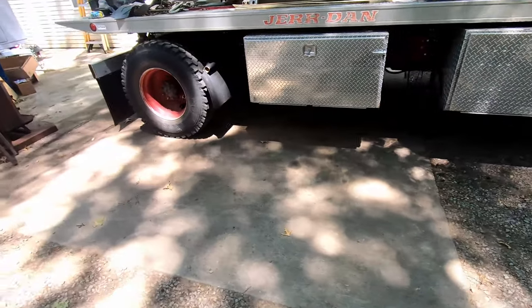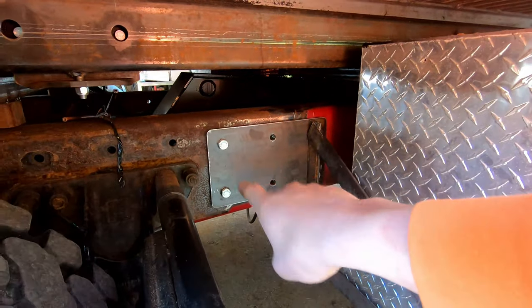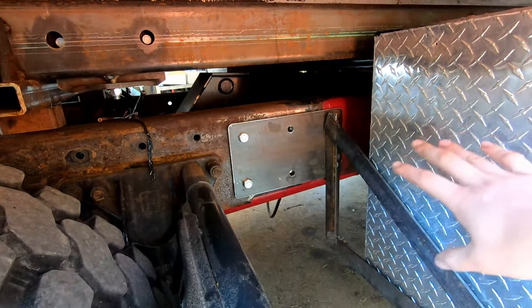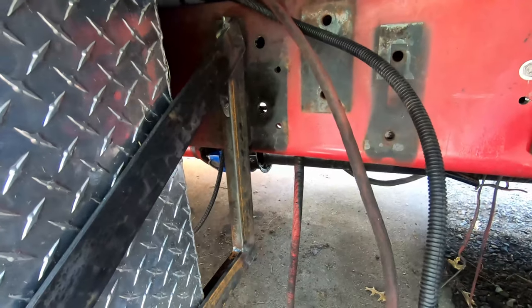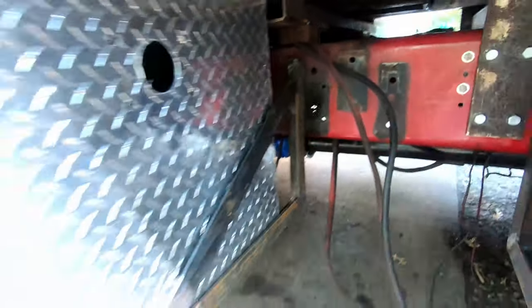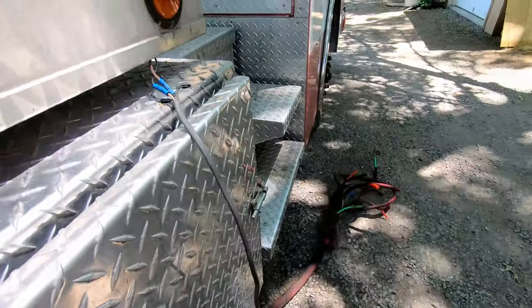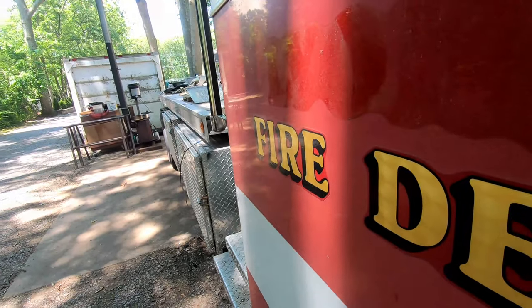Look at the toolboxes — that looks good! I made these simple toolbox brackets. It's two pieces of angle and flat bar with a couple holes drilled. I actually utilized some old holes from the frame support bracket — that's where the frame got welded together — and then I added that bracket in for extra support. The weld will never break but it's there just in case. There's a 3/8 spacer in there to keep it all level, and the boxes are the same width as the body.